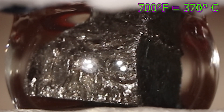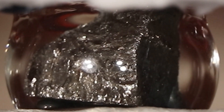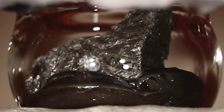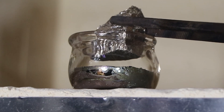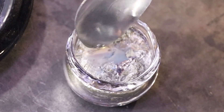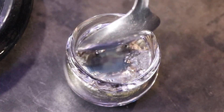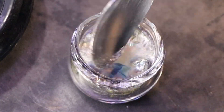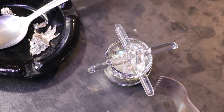I have a chunk of the bismuth in the jar now, in the kiln at about 700 degrees Fahrenheit. It does melt at 500 degrees, but being a large chunk, it takes some time to soak in that heat — a bit like putting ice cubes out in the sun; it is hot enough to melt them, but it'll take a little bit of time. Speaking of ice, that's actually a good example of the nucleation process — water can drop below the freezing point without freezing, especially if there aren't any impurities or other ice crystals nearby. I'm going to skim off this top layer for any impurities. As I move it around, you'll notice a mirror-like finish, but it quickly forms a cloudy oxidized layer. I'll set in the nucleator and place it back in the kiln to cool down more slowly.